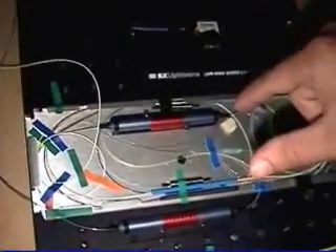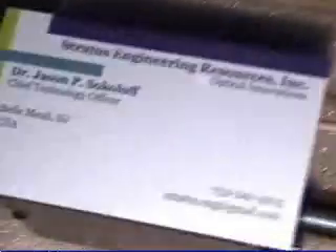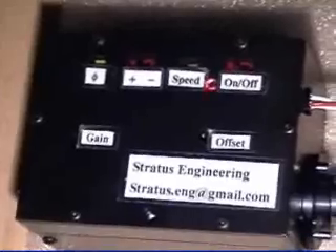One way of looking at the train of pulses is to use a fast photodiode from one of the laser outputs, like this one, which in this case is not hooked up. A second way, which is useful for looking at the actual optical pulse shape, is to use an autocorrelator such as the one here that was beneath my business card.